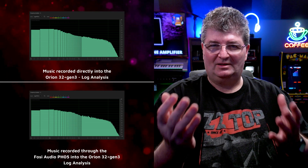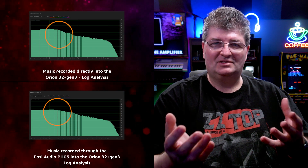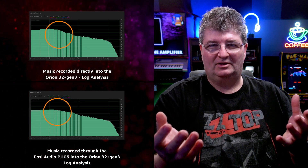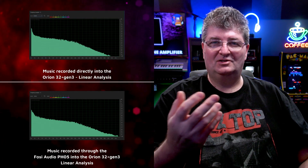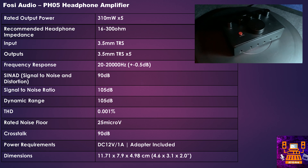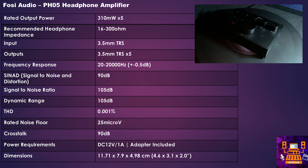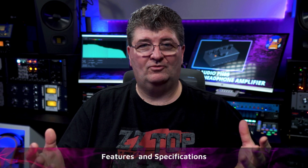In the comparison of music recorded directly into my interface versus going through the PH05, when we look at these graphs we can see some coloration in that 100 to 400 hertz range — it shows up really in the logarithmic results. When we switch over to the linear analysis, things look a lot more even all the way across. Could you hear it? Let me know in the comments. Key specs: each headphone output has its own amplifier that delivers 310 milliwatts and can drive a lot of different headphones. Signal-to-noise ratio and dynamic range are both 105 dB. This is not designed for a mastering situation — it's a monitoring application — and overall the specs line up pretty well for the price range.